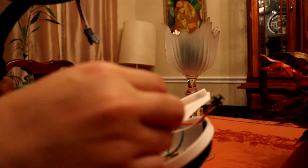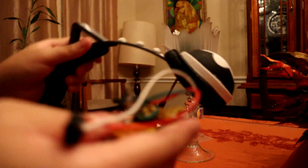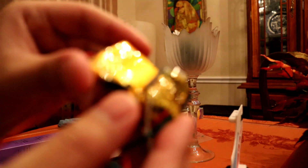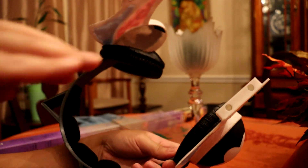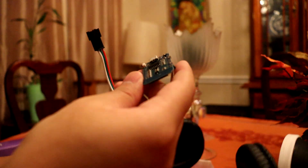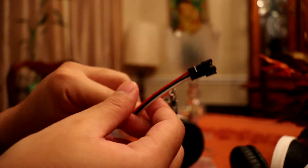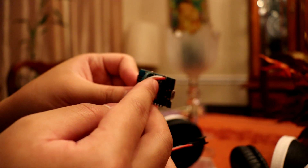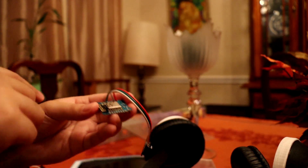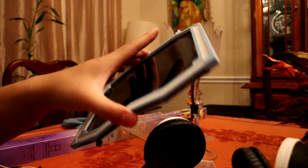On the left side, this might look like a complicated mess of wires, but really it's just the battery attached to a battery charger unit and also an on/off switch. You can charge it by USB-C. Then in the other ear cup, we have the actual board — really simple, just three wires soldered to it for 5 volt, ground, and then the signal wire, which is what controls the front panel.